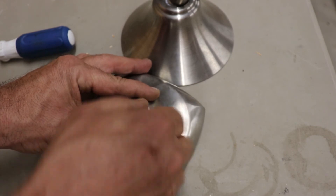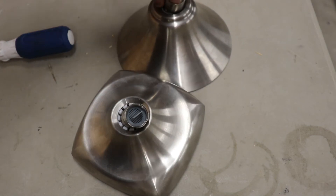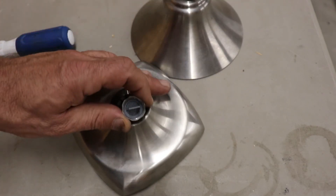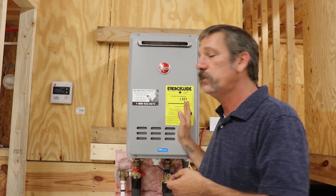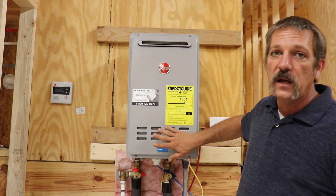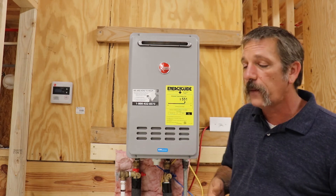Put your little screen back in — this plastic screen works just like one of these little rubber washers. These are just two different brands put out by pretty much the same people, just different names and price points. To summarize: you're going to have to take those water savers out of shower heads when dealing with the new style tankless water heaters. You've got to keep those flow rates up and keep that water moving, or the tankless unit won't know you're asking for water and won't make hot water.